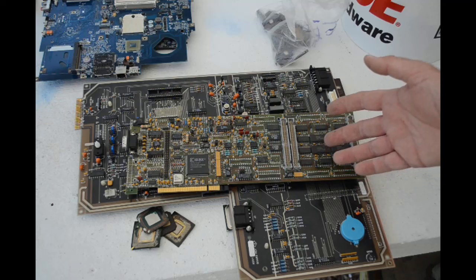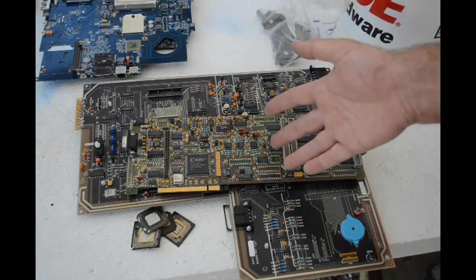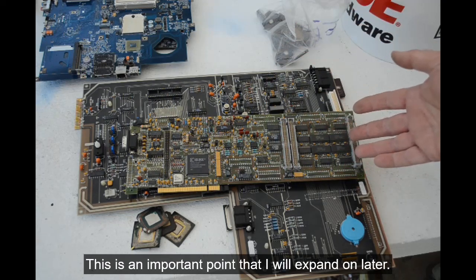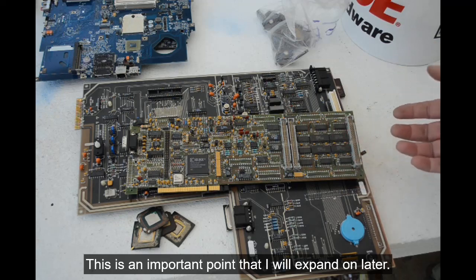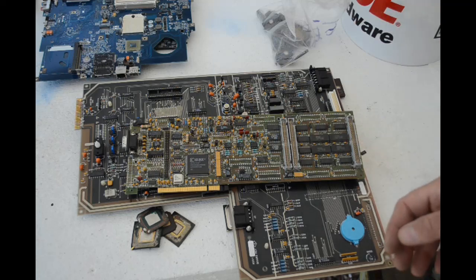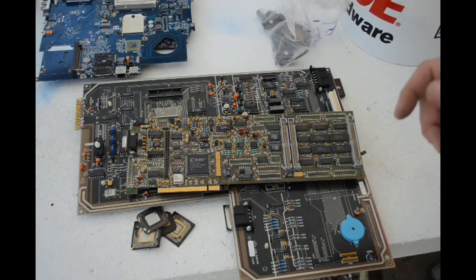And what I have found, actually, surprisingly, is a lot of the parts that I have depopulated off the boards in the kiln are actually still good afterwards, can be reused. I have an IC chip tester and programmer, and I will sometimes take some ICs off the bottom of the kiln and say, oh, that's a useful little RAM chip, or that's a useful little EEPROM chip, and I'll test it, and it's like, holy cow, it's still good.